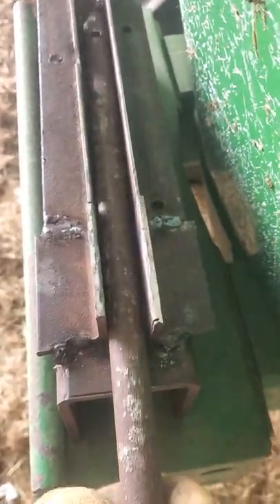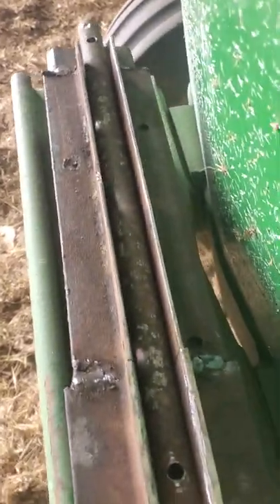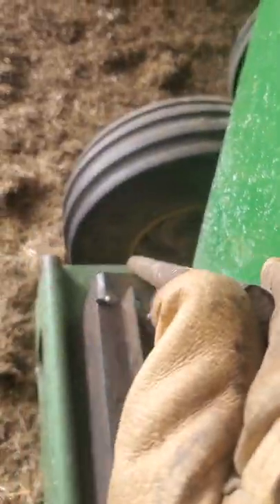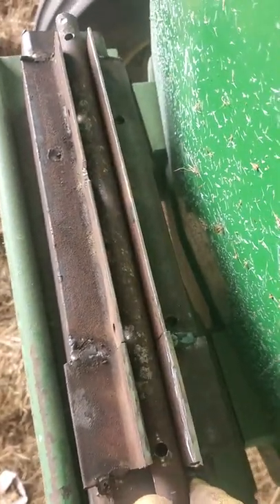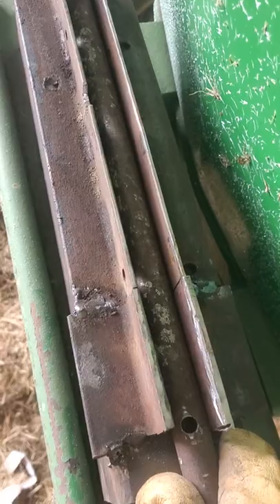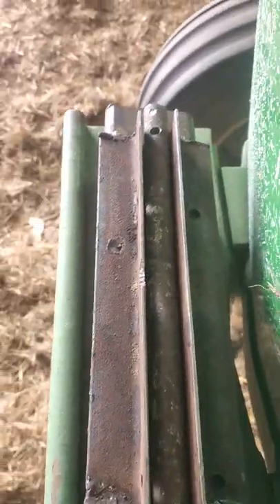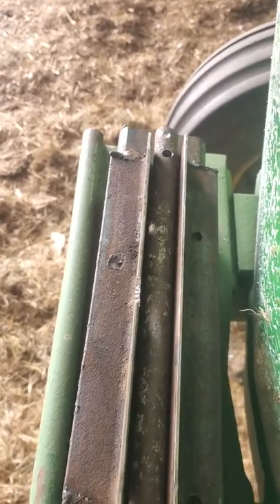I have the rod that you're going to need to press in it. I think that's three-quarter inch. I don't know what you're supposed to use — it's like 22 millimeters or something, I heard. It doesn't really matter. And if you're worried about it, just wrap this in some tape or something. It should get rid of the small metric to standard size differences.